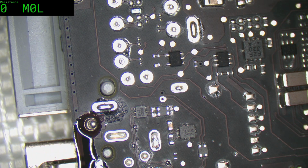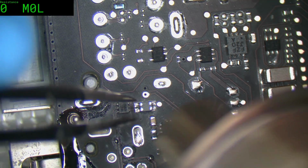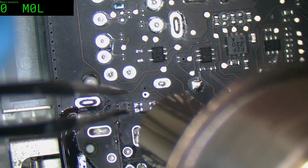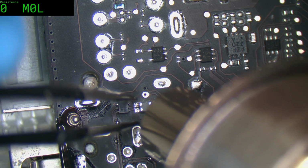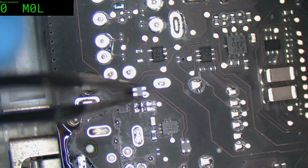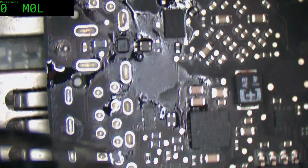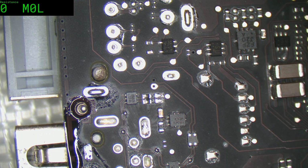I'm thinking that the bent USB connector has actually fractured these things. So I'm replacing this one out of abundance of caution. They are very sensitive little critters. Yeah, there we go. So that one's cracked too. So we've had a massive flex along here. Goodness knows how many of these things it's taken out. There you go. Well, that'll explain why it worked, but then didn't work.